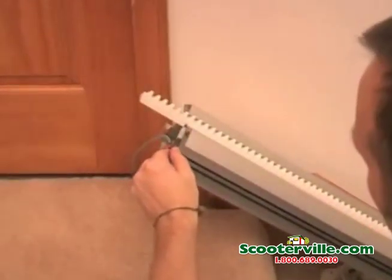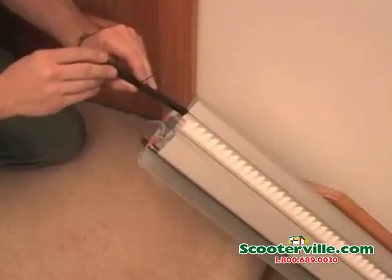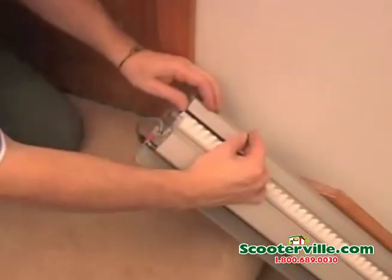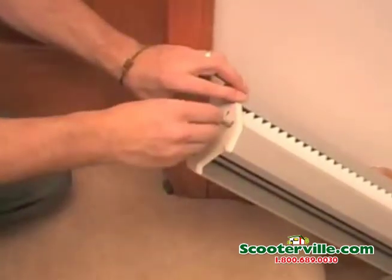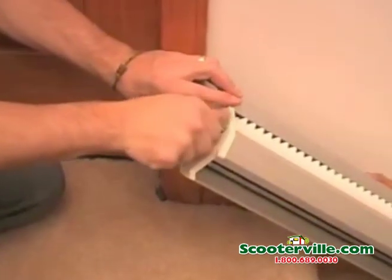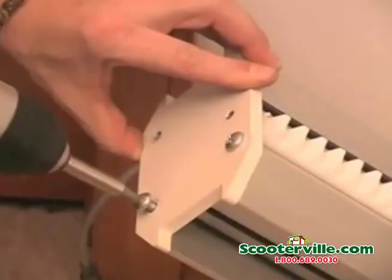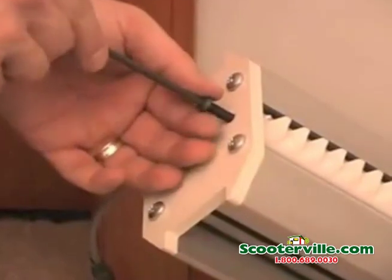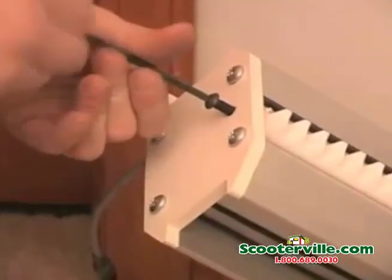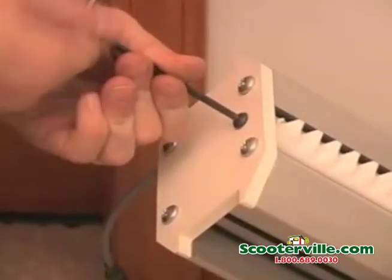Install the remaining rack and cut off the excess with a hacksaw or chop saw so it is flush with the top end of the rail. Put plastic on the floor to catch cuttings or mark the rack and cut it outside. Install the top limit cam and tighten with a 5/64 inch Allen wrench. Install the end plate with four self-cutting Torx screws. Apply grease to the threads and do not over tighten. Select the proper pre-compression screws and tighten with a 5/32 inch Allen wrench: use a half inch for tracks under 6 feet, 3/4 inch for tracks between 6 and 12 feet, and 1 inch for tracks over 12 feet.